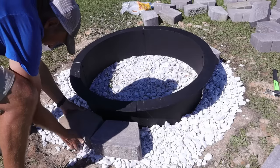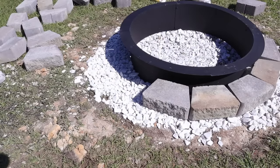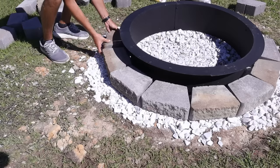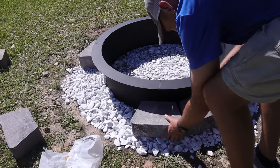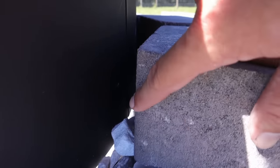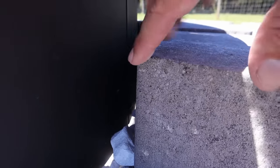So now I've got the old fire pit completely filled in. I've got my stones down nice and level, and now I can start laying the lowest level of the stones that are going to be stacked around the outside of this fire pit. I'm leaving at least an inch and a half gap or so between the inside of the stones and the fire ring. I want to have a gap here — an envelope basically of cool air — where eventually that cool air is going to be introduced into where the fire will be. And that is what will make this whole thing smokeless.